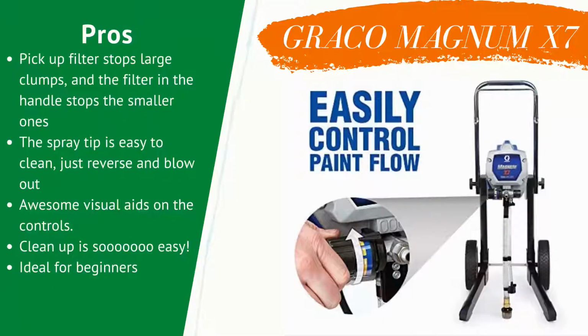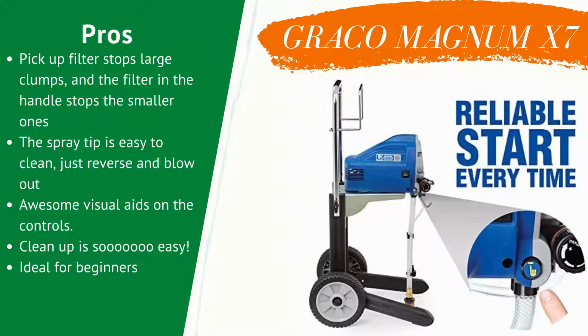Pros of Graco Magnum X7. First, pickup filter stops large clumps, and the filter in the handle stops the smaller ones. Second, the spray tip is easy to clean, just reverse and blow out. Third, awesome visual aids on the controls. Fourth, cleanup is so easy.